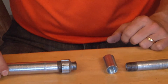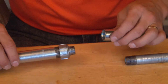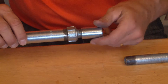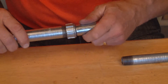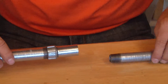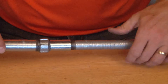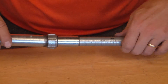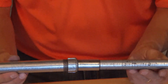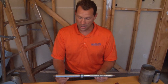Once you have the large pipe with the fitting in place, you can now use a standard rigid coupling to attach to the male threads of a like size. By aligning the threads on the male side, you tighten it on and get it nice and tight, which then reduces down the threaded opening for the smaller pipe. By screwing this in place, you've completed the coupling transition — taking 3/4 inch conduit down to 1/2 inch conduit, or said another way, taking 1/2 inch conduit and enlarging it to 3/4 inch.